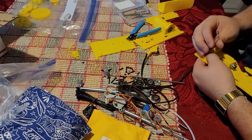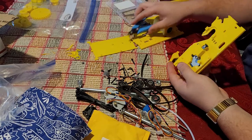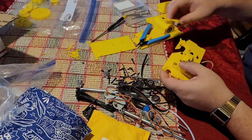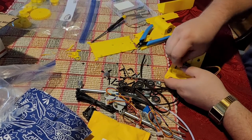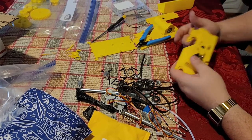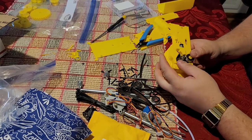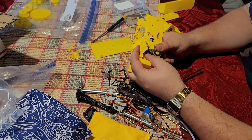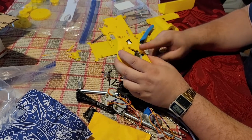This hole here gets cleaned out, and this piece slides in. A 20mm screw goes all the way through. The extruder needs a second bearing here to counteract the clamping forces the filament makes so they don't break the shaft. It basically lengthens the life of the motor and prevents people from cranking it down so tight they break the motor shaft right off. There's a washer coming for those — the current 9.5 kits don't have that.